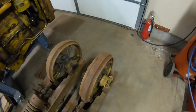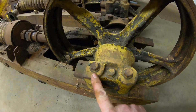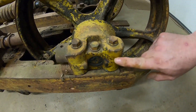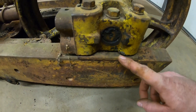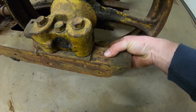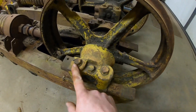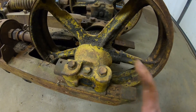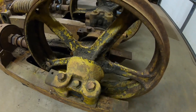We'll be doing a lot of that. Before we can slide the idlers off the track frames, we need to loosen these two bolts. Those two bolts exert pressure on springs inside these round housings here. Those springs exert pressure upon this shoe, and that shoe — with some brackets and wear plates back here — exerts pressure upon the top of the frame channel, keeping that idler from flopping all over. We'll back these four bolts out to loosen this and fight through the rust, which should give us the easiest time possible sliding that idler off the front of the frame.